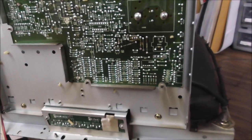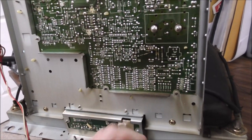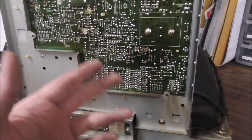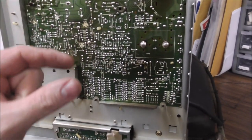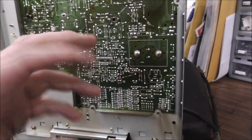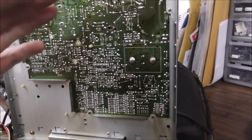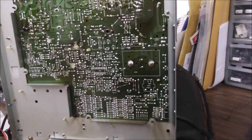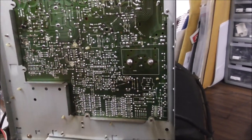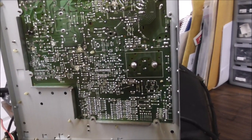So it was still working from 1985 or whatever — yay, Sharp Electronics! When the capacitors get old, they dry out and voltages change, so things start not working right. You saw how the thing was collapsing and then coming back up — usually that's because you've got bad solder on a cap or a resistor. A cap kit and touching up any bad solder you find will usually fix stuff like that.